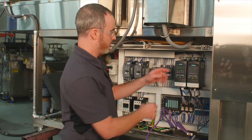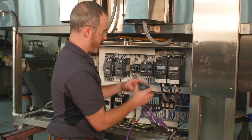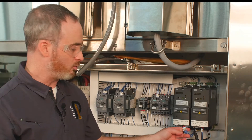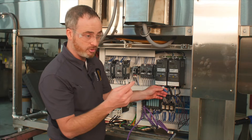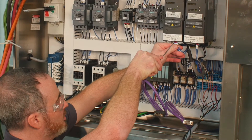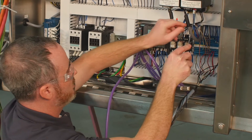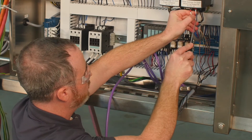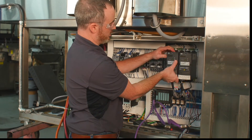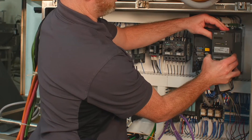Continue the demo by removing the individual pieces of the MicroMaster drive. Start with the keypad — discard. Next, remove the 24-volt wires that power the control units; we'll repurpose these on the new control units. Use a flathead screwdriver and carefully insert the spring-loaded terminal to remove the wire. Do the same on the next VFD. Then completely disassemble the control unit by pressing the buttons on the top of the VFD down and carefully sliding it off — discard.